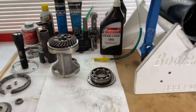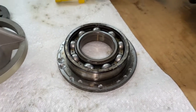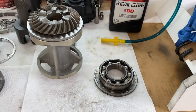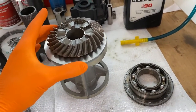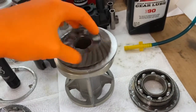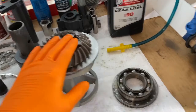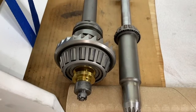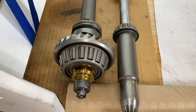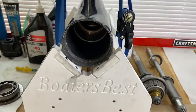Taking a closer look into the left side of the lower unit, there is our old bearing and thrust ring that came out of our old and badly damaged bearing carrier. And there's the new bearing carrier, the gear, and the thrust ring. This is the reverse gear - we'll install that later in the project. To the right side of the lower unit, here is our brand new drive shaft and propeller shaft with the bearing, gear, clutch dog, and shift mechanism. We are going to reposition that and lubricate it prior to installing it back into the lower unit.